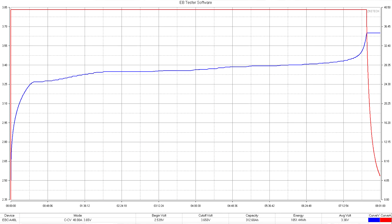The question frequently asked under my videos is: Andy, when should I start balancing my lithium iron phosphate battery pack? While this seems like a very obvious question, many people still get it wrong. When I look at the parameters and settings of viewer setups, the balancing start voltage always catches my eye - regardless of whether they have active balancers or passive balancers built into the BMS. Some of this misunderstanding has to do with the LiFePO4 charge curves, which are super flat, with voltage increase only around 95% charge. The misconception is that because the balance current is so small, you have to start balancing early - but this doesn't make sense with lithium iron phosphate.